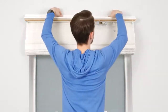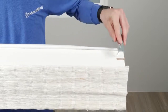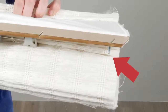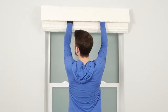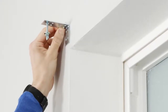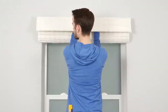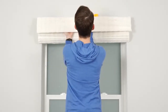Bamboo shades are one of the easiest window coverings to put up. The one I'm putting up today has these handy slots in the headrail, which make it simple to position the brackets and attach the headrail. The first step is to determine where to place your brackets. Outside mount shades are hung above the window. The brackets will be screwed into place through the two holes on the back of each bracket. Depending on the size of your brackets, you'll need a minimum of 5 eighths of an inch above the top of the window. With the shade facing you, center the headrail over the window. Place a level on top to keep things straight, then take your pencil and mark the location of each slot.